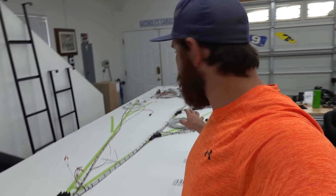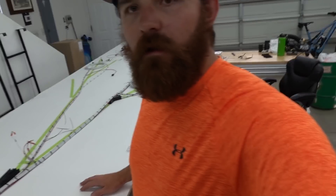All right, so we have a full harness finished. Back shells are complete, most everything's tied off until we get to the front here. But that brings me to a good point of why we did this. Wiring is a really daunting task for a lot of people — I know it was for me — and I have a decent amount of experience in wiring things. But it still took me the better part of 200 hours just to learn the system and know exactly what I was going to do prior to going in and just throwing wire. So what we've come up with here is a setup that allows you to put the whole aircraft wiring in in less than a day — that includes your wing wiring, all of your Garmin avionics just plug right in, everything has a spot, it bolts up, and you're done.